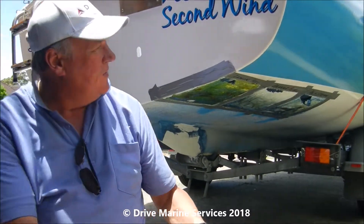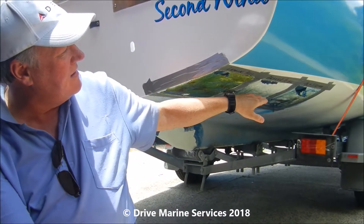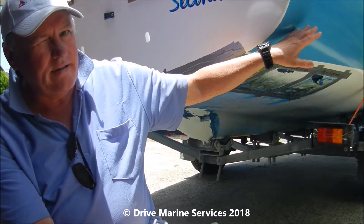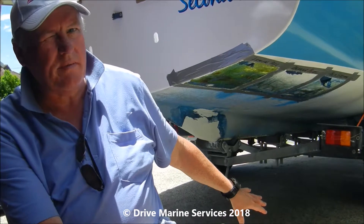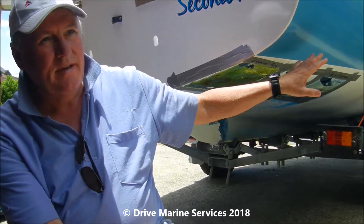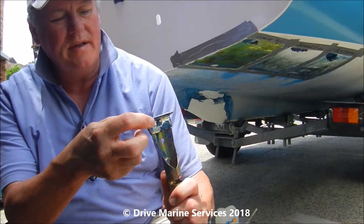Thanks Dave. When I originally got the boat and was going to re-spray it, she'd been anti-fouled to the top of the bootstripe line. Just to get that off so I can paint it and decide what I want to do afterwards, I tried sanding it off — that didn't really work, it was messy. I tried the orange peel paint stripper, that didn't touch it — it just made no difference, put blue everywhere. I tried the poly strip which is pretty severe, and even then with a carbide tip scraper I could get a fair bit of it off.